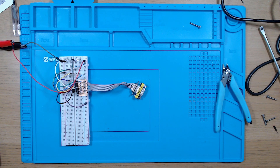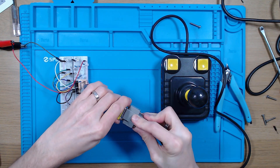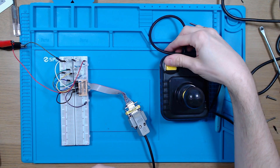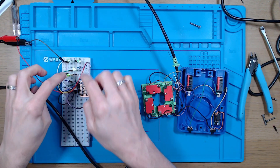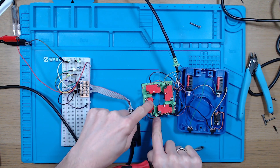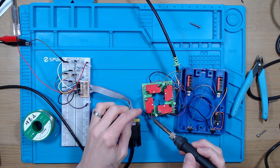So everything's wired but we need to test it. I've built myself a little joystick tester. I'm going to test it on my zip stick first to check that it works properly. Up, left, down, right - yep, that works. And the fire buttons - yep, the fire buttons work. Onto my joystick - hmm, that doesn't seem right. There's four lights on there that shouldn't be on at the start. It looks like we've got two of the directional switches wrong, and we've also got the fire buttons wrong - we should have been using the other pins. Did anyone else spot that earlier? So we'll go ahead and fix those now.